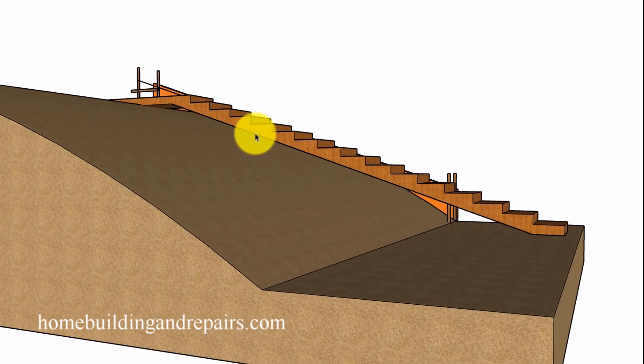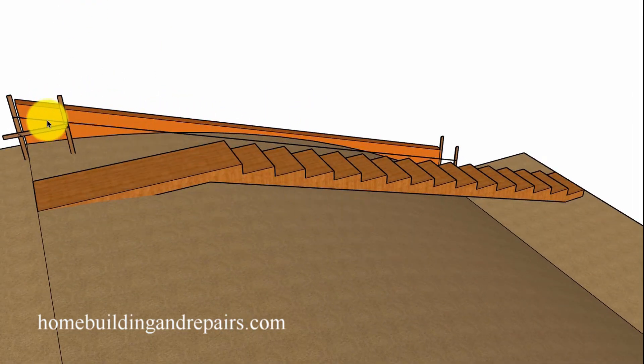We won't need to remove any soil, but we're going to need to install some type of supports to make the stairway stronger. That is it for the video. The main reason I wanted to do this was to give you an idea about using a string and a couple of guide boards with a framing square to figure this out. There are other math formulas you can use — if you're good at math, you probably already know them. If I ever make a video with those formulas, I'll attach it to this one. But I think this method simplifies everything and makes it possible to build a set of stairs on a hillside and figure out what the tread depth and riser height are going to be.